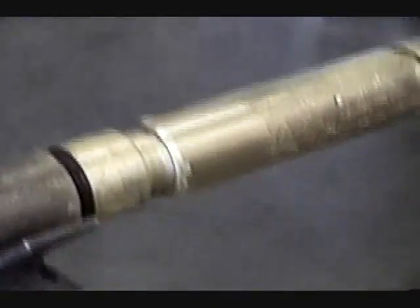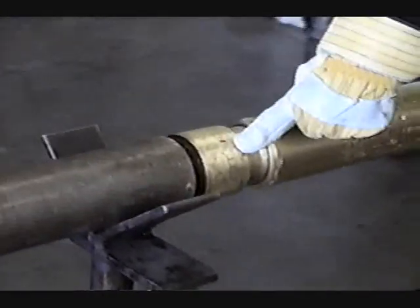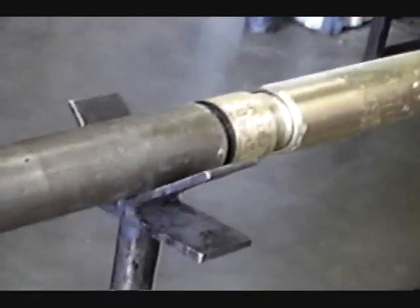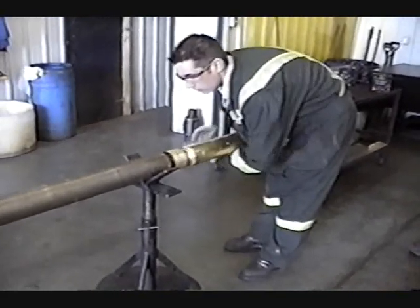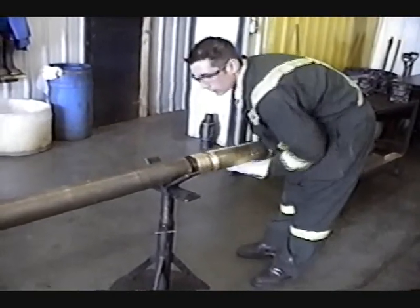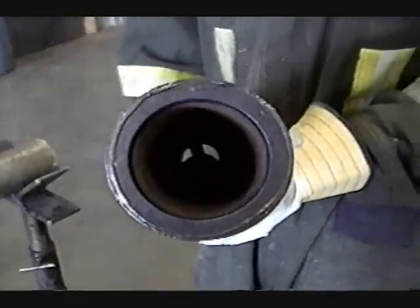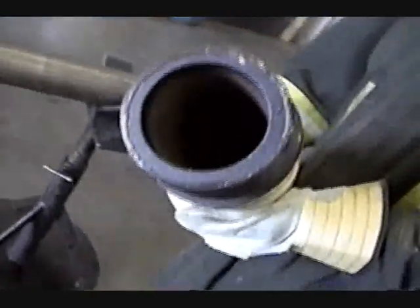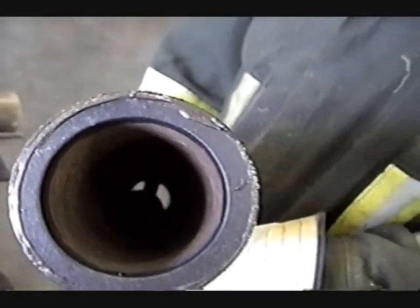There's a swage, and this connection at the very top of that ball valve is the tubing baler barrel connection that threads into the bottom of the barrel and also threads into your ball valve, so Dwayne's going to take that out. That can usually stay together as one piece unless there's thread damage. You can see inside there — there's the bottom ball valve, the ball valve just dangling inside of there, all connected together.